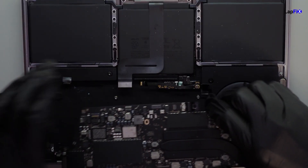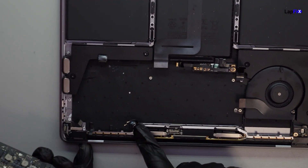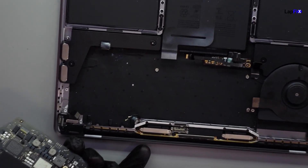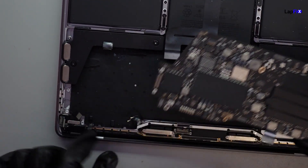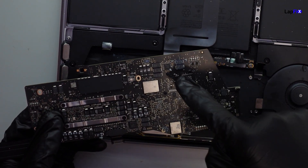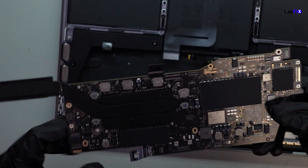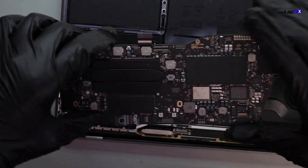So let's go ahead and open up the board. Maybe there's liquid spill more on the other side, especially if it's been open. We want to take a look anyway — there could be damaged components, ripped components. Let's remove the board and lift it up. We can see signs right here — it's a little bit of blue. It's like Blue's Clues. Blue means corrosion, usually. And that's what we've got — some around this area and around here. But it would be better if we go under a microscope so we can all see it. Let's do that real quick and take a look.